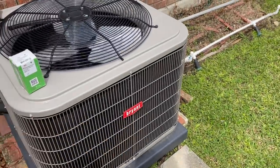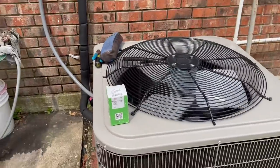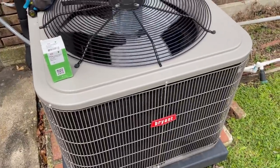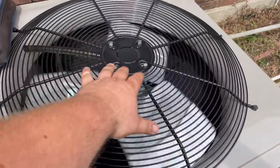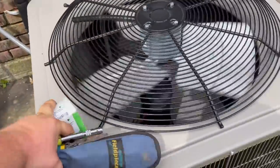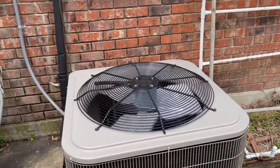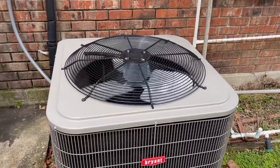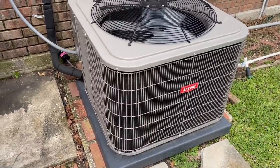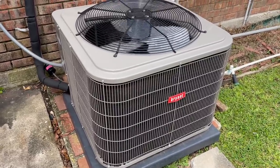That's why now when I install a Bryant, we go ahead and buy the system, buy a Trade Pro green cap — the American-made one from Baker — and we swap the cap out before we fire the system up. So she's pulling good heat. I've already got the model and serial number off of it; I'm going to go to Baker and make them give me a new warranty capacitor — they'll give me another green Trade Pro to restock my truck. But it's a very nice system and she's been very happy with it. She was a little disappointed this morning — not even a year in and already broke down. But I explained about the Chinese capacitor and she's okay.